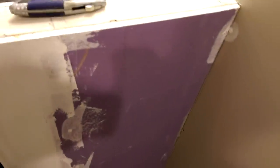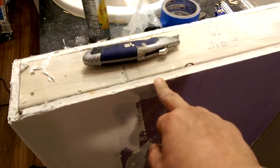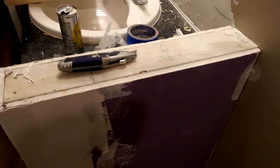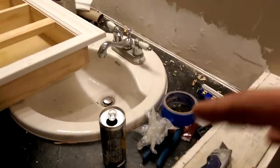This is the wall — the little half wall — where the shelf or niche is going to be. I'm going to use the top of the casing, right flush with the top over here, and the cutout is going to be right there so we can inset it in between. Previously I marked the areas where the studs are, so I know exactly where I need to cut, and that's why I made my size according to that. This surface is going to be changed for stone later, so it's a little rough but that's okay.